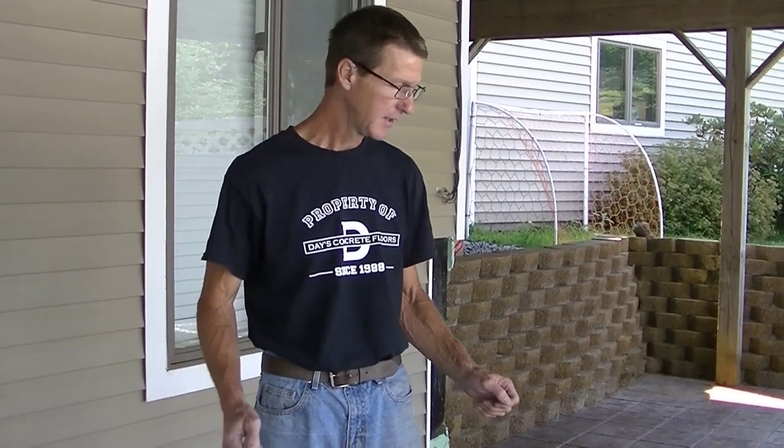All right, so what's the best way to apply the sealer when we start applying it? The first thing I like to do is have somebody with a pump-up sprayer, and they're going to be spraying the sealer on. You'll see us do that in a second. And then right behind the person spraying, I like to have somebody back rolling with an 18-inch, 3/8 nap roller. What that does is it really helps mix the old sealer with the new sealer. So you're going to be pushing the sealer right into each other and creating a really good bond.